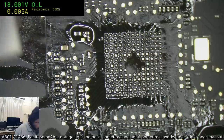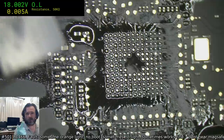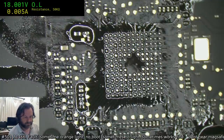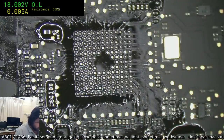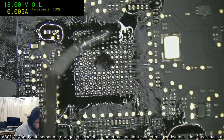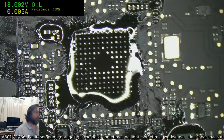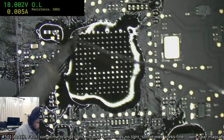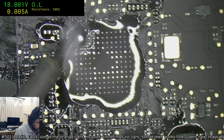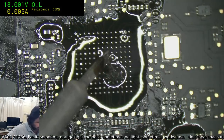I don't really like doing the whole twist it to get it off thing, because you can just have one solder ball that's holding on a little tighter, and you do the whole twist off method and you won't feel it, but that will probably rip out a pad, and then you'll actually have something to cry about rather than just the fact that you're gonna have to do a reball. Give me my heat.